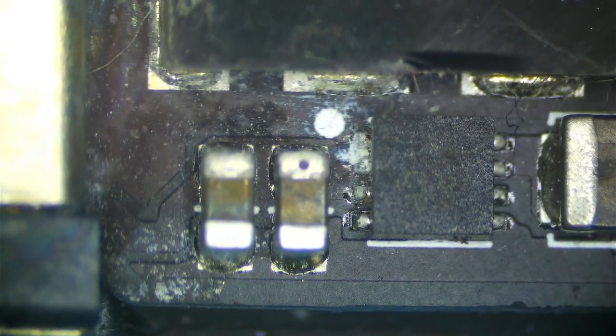Look around here. Wi-Fi card has some corrosion. Nothing by our CPU. Now, the customer didn't complain of Wi-Fi issues, but that's a little bit concerning. No, that's cosmetic, but I don't want to leave that, so I'm going to address this. This has apparently been working with no backlight for years. Yeah, that's just superficial. That'll be fine.